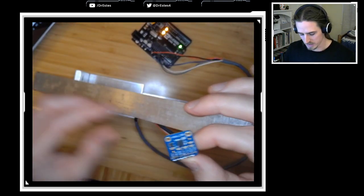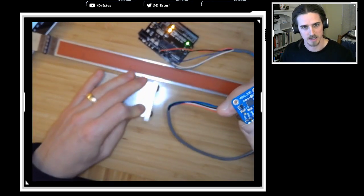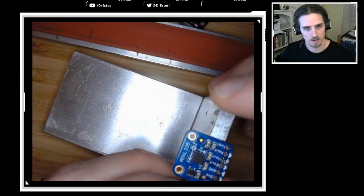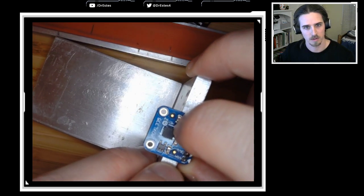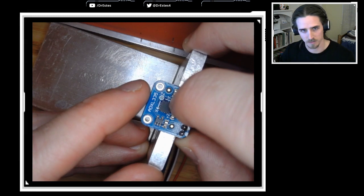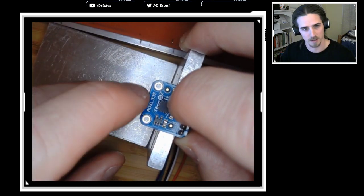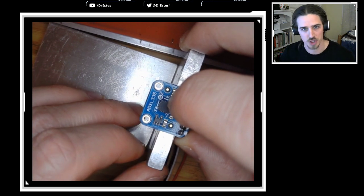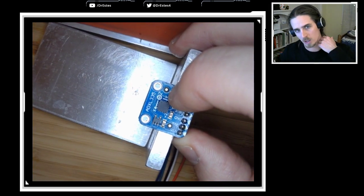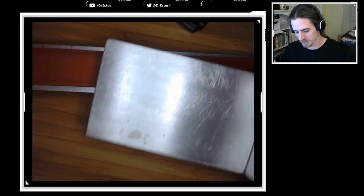Or if I hold this sensor flat, one way to do that is just use this piece, set it down on a flat surface, and then if I just put this right on top here with the x-axis pointing level, there shouldn't be any gravity. I don't know how level this table is actually, but the point is, if this is pointed perpendicular to gravity, then I should be introducing zero g's of acceleration right now. And the inertial acceleration is zero because I'm holding this perfectly still. So this angular jig is going to allow us to apply different accelerations here.